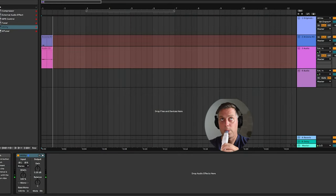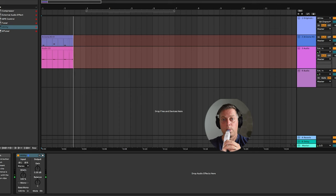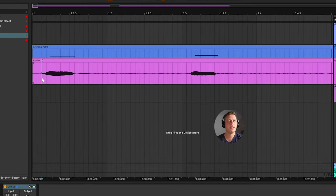The recorder is pretty responsive, but the MIDI does introduce a little bit of latency. It's especially noticeable when the volume is turned up and the VST you're using has a quick attack. Not that anyone would probably think so, but this does mean it's probably not the best device to record drums. As you can see here, the tone starts but the drum sample is only triggered slightly after.